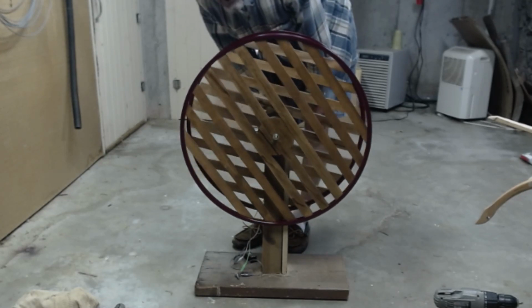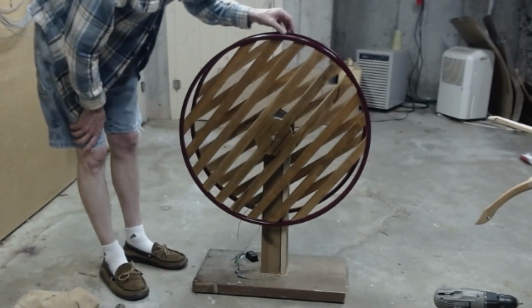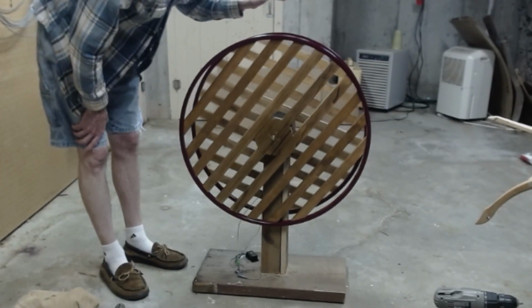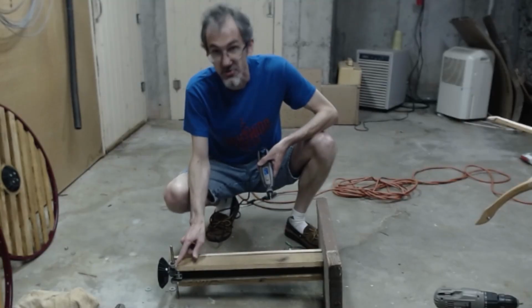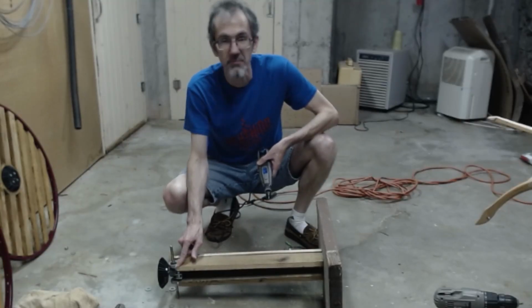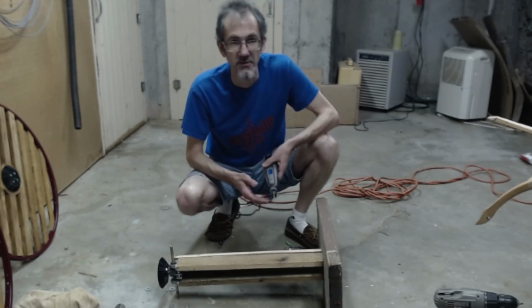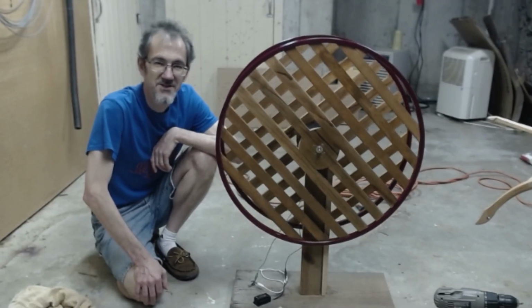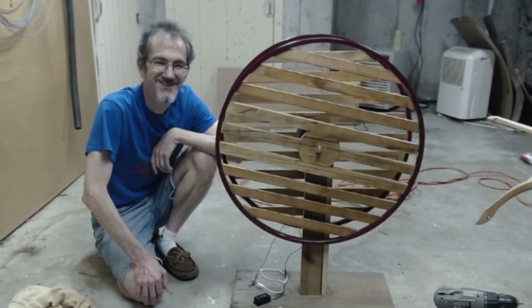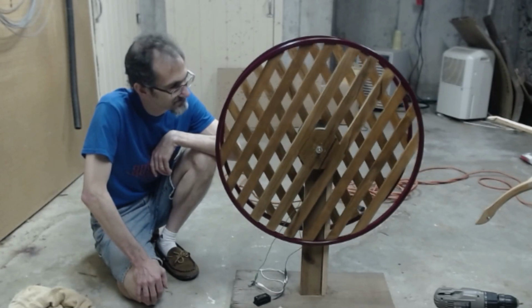I'm afraid if I put in an extra washer, the gears won't mesh. Yeah, with an extra washer, the gears are not meshing. It's barely even touching the gears. I'm going to use a Dremel to carve where the gear is rubbing up against the wood, and I'll carve a little groove for it. Hopefully that'll stop it from squeaking. The Dremel fixed the squeaking. It works now. I still have to clean up the wiring, but yeah.